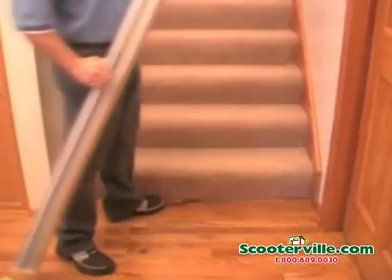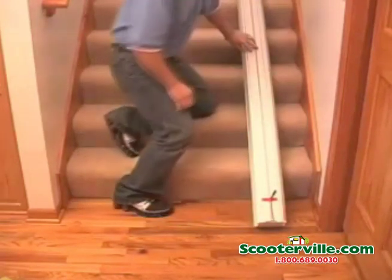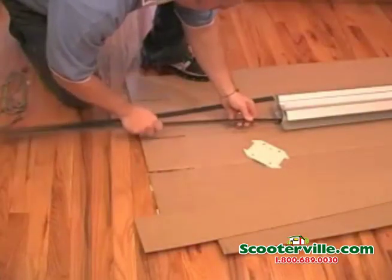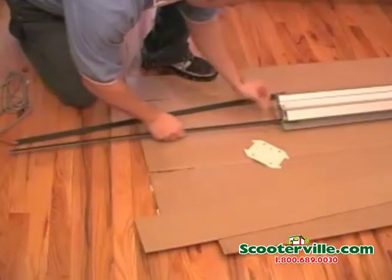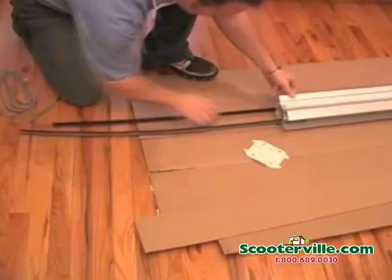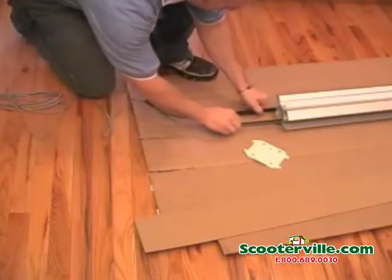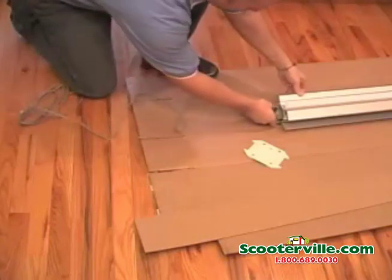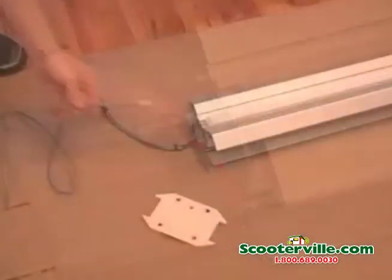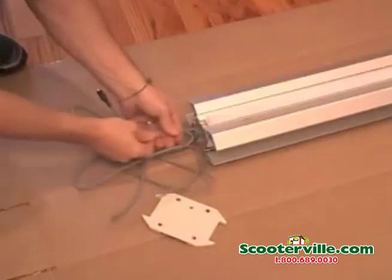Position the bottom rail with the end plate towards the bottom and the plastic rack facing down. You may need to place something heavy at the end of the rail to prevent it from sliding away from the stairs. Insert the two charger strips into the keyed slots at the top of the rail and bend the red and black wire tabs inward. Next, push the charger wire through the inside of the rail with the connector coming out through the joint end.